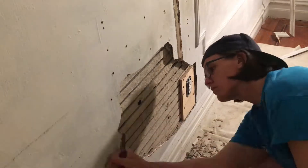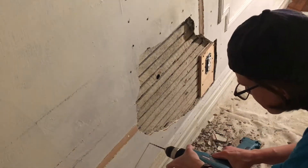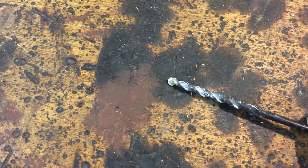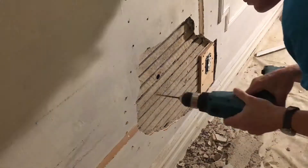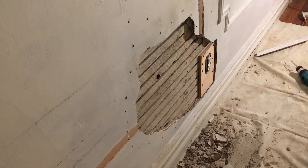Let's talk for a second about the drill bit. You're going to see me come back into frame and drill some more holes. This is a 3/16-inch masonry bit, and the purpose of using a masonry bit is so you don't drill holes straight through the lath — just through the plaster.